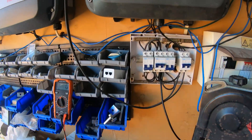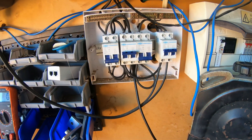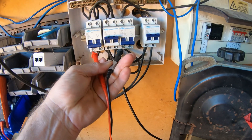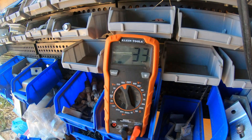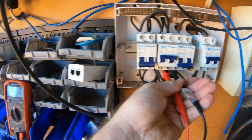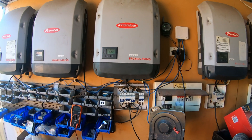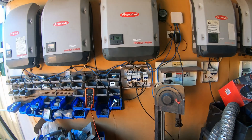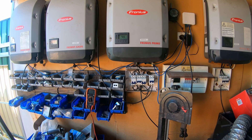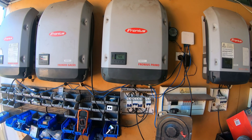It's the next day and there's no good news. We ran in that extra cable hoping to bring on another 1500 watts of production before winter, but it's no good. Probing the panels — they should read 167 volts but one's reading about 100 volts. So we've got a bad panel up there. If it's only one bad panel I can remove it from the string, then remove one panel from the string below it as well, and we'd be down to two and a half kilowatts — still better than the 1200 watts we're seeing now.